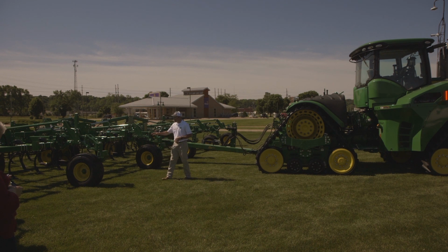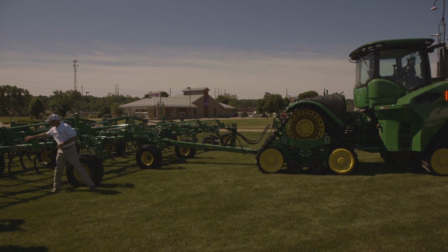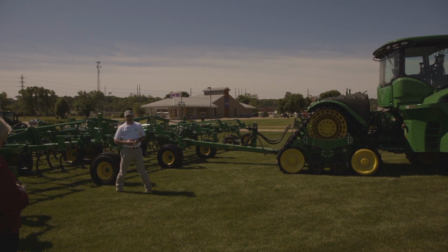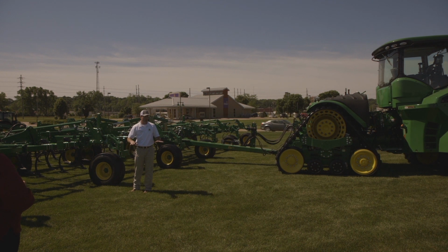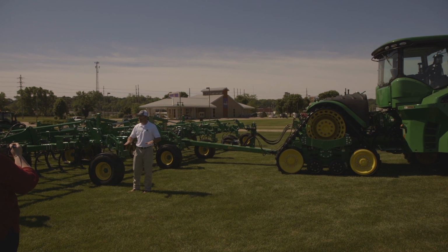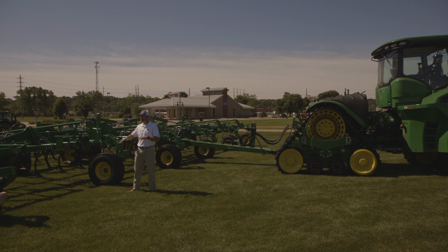use. But also when you look into our shanks here, our true position standards, 200 pounds of trip force here. Another very key feature that we've got here with 200 pounds of trip force to keep those shanks engaged in the ground, keep those sweeps engaged in the ground so that you're getting that level cut all the way across the field for that consistency. What happens if those start tripping? You're going to start getting some undulations, right? Uneven. That can equate to the planter ride quality. Getting a bumpy planter ride, your accuracy for depth isn't going to be as ideal as it needs to be.